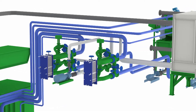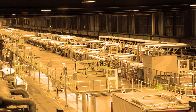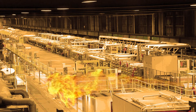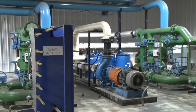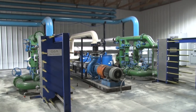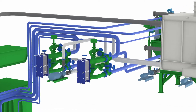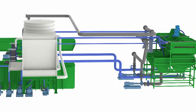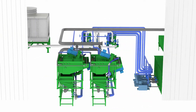The transport of grit and water around the cell generates heat. The temperature control system removes the heat from the EPS cell, which differs from acid pickling, which must add heat to its process at significant cost to maintain the desired operating temperature. The filtered water passes through plate-style heat exchangers, which expel excess heat through the cooling tower.